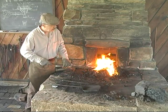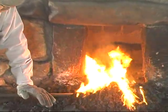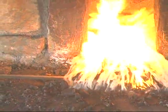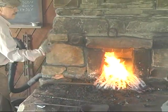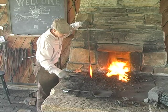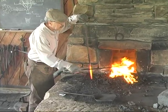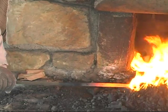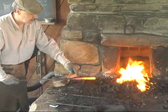If you place a piece in this way, it's not a good idea. What you want to do is lay your iron on and push down and slide it forward. What you're trying to do is feed the tweer with coal — feed the coal down to where the air is coming in. You can see how quickly it's heated that half-inch square stock. Notice how it's red here, dark here, and dark here? That's because I shoved it through and this end was into the green coal on this side. If I want that end just to be hot, I'd push it in that hole, push in a little bit more coke, and push it in about that far. You'll see that the end is now hot, and it's cooled back in here.